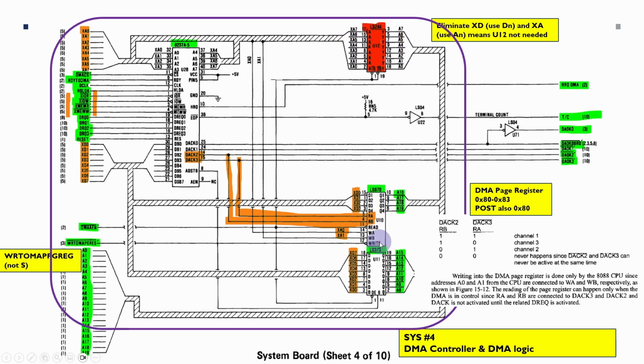There is a RAM chip here, which is a 4 bits by 4 address RAM, and this is used to provide the top 4 address lines, so A16 to A19, for the DMA requests. Now, the thing which is a little bit confusing here is that the feed into the address lines for this for output only come from DMA acknowledge 2 and DMA acknowledge 3, so these are active low. But I have got an excerpt from a book that I'll reference in the description below that actually explains how this works. Basically, when DAC 0 or DAC 1 are active, because DAC 2 and DAC 3 will then be high, then address 3 will be enabled. Then when DAC 3 is low, then we'll have this address. And then when DAC 2 is low, then we'll get this address. Now, you can never have both of them low because only one of these can be active at a time.